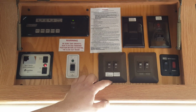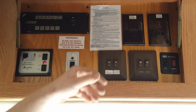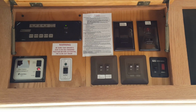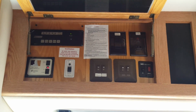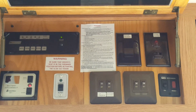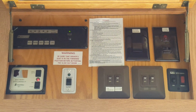Want that on? Well, I was checking. Okay. Do we want it off now? I can turn it off. Yeah. But I was just checking. And how often do we turn it on? Just like an hour before we want to use it, or something? I mean, yeah, about an hour before you want to use it. If there's a lot of people taking showers and you want hot water consistently, the quickest way to heat it is the LP. So use the LP because it's going to be able to fire and heat it up better versus the electric one.